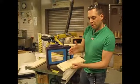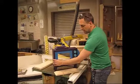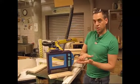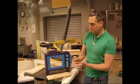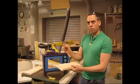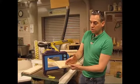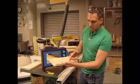The important factor now becomes the piece that we use to slide in, okay? That little piece. Now I use 1/4 inch door skin plywood for mine, but depending on where you get it from, you want to make sure that you've cut it appropriately, because some of the wood I get is slightly more than 1/4 inch and some of it's a little less. You don't want it so thin that it wobbles. You obviously don't want to cut it 1/4 inch and then realize your piece is a little bit larger than that. It's really difficult to fix after.